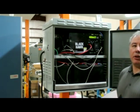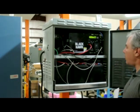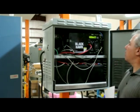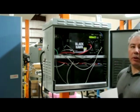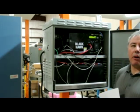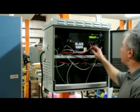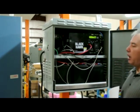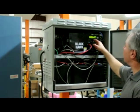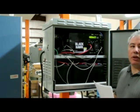Record the battery temperature and the inverter temperature. LCD should read battery 1 amp, 0 volts, press to charge. Output power, which is recorded — in this case is 620 watts. Input power, which is recorded — in this case is 900 watts. Back to output voltage and current.